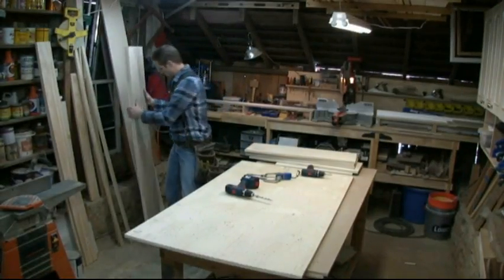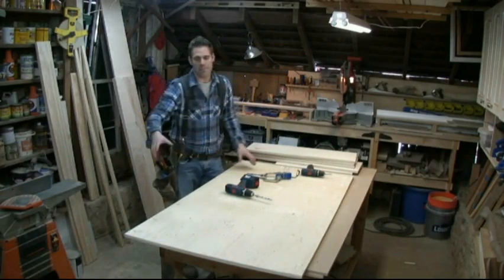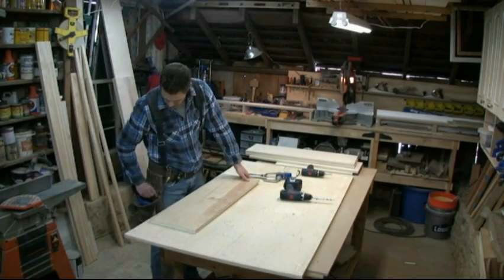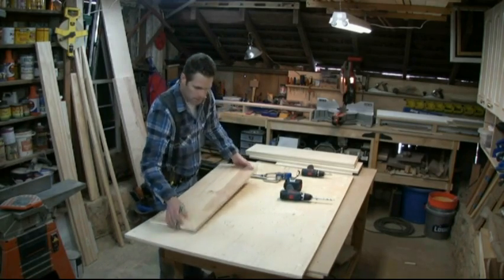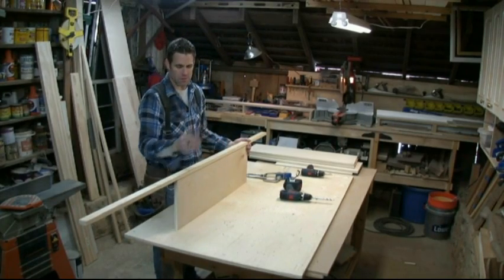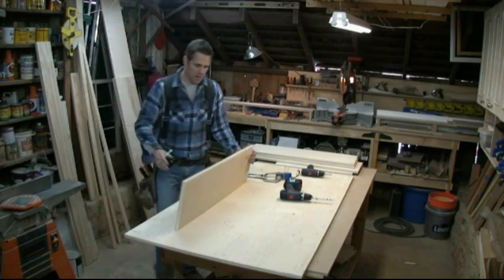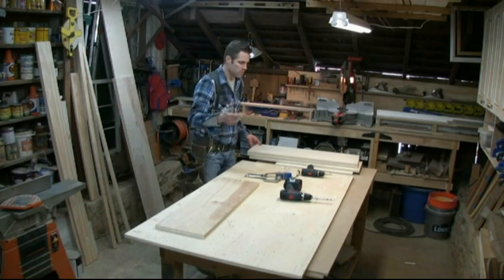The sides don't have any pocket holes, so I'll get those out of the way. Our back does because it's going to get inset — all I did was put pocket holes all the way around the back, not the top and the bottom, just around the sides. For the shelves, we need to attach them to the sides, so we're going to put pocket holes here, here, and here — three per side. We're also going to put them underneath so that we can attach the face frame, which is going to be this detail across the front. That locks it in. Anytime we can avoid using nails or biscuits or anything like that, it makes for a stronger frame, and we don't have to fill those joints. The pocket holes will be hidden from underneath. So all the shelves are going to get pocket holes — three along the sides and then probably four or five across the front. I'm going to cut all those now.